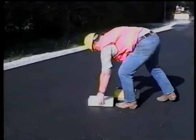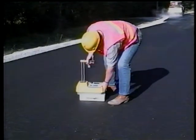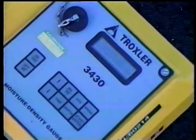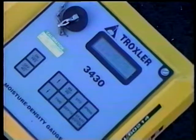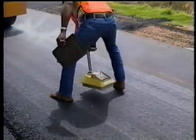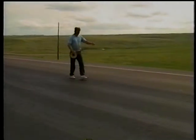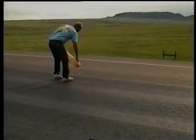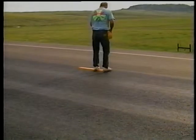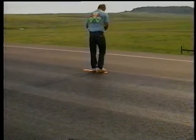The density of the pavement may need to be checked. Some agencies use nuclear density gauges and require all gauge operators to be formally trained and in some cases certified. While it's important to roll the mat until it's dense enough, it's also possible to over-roll — too many roller passes may actually begin to reduce the density. After the pavement has been compacted and cooled sufficiently, temporary pavement markings should be placed along the center line if the pavement will be open to traffic, and these markings must be placed for the full length of the area paved by the end of each paving day.